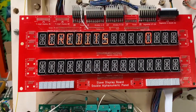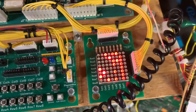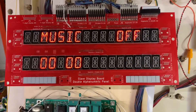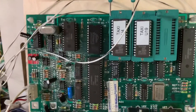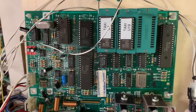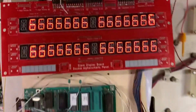So let's boot it up. Turn off the light here. You can see that the lamp matrix is doing what it's supposed to, and the only solenoid on is the AC select relay. All those sounds were actually coming from my taxi soundboard — a soundboard with taxi ROMs — and that proves that the MPU can in fact drive the correct sounds to the soundboard.